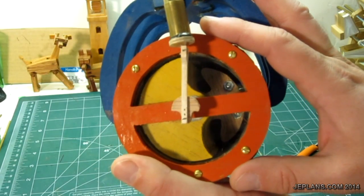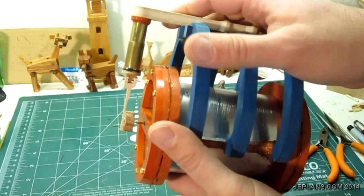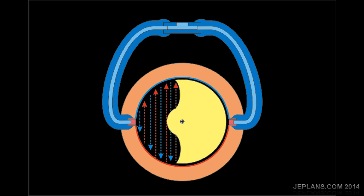I am not giving up yet, so let's look at what could be the problems and apply some things I do in my more conventional displacers. First, when the displacer is at 90 degrees, half of the hot side is exposed to the cold side at the same time, as well as most of the air being exposed to both — this would greatly reduce the temperature swing of the air. Second, too much air space. In my plunger type displacers, I would typically have a max of 12 millimeters or about a half inch of air exposed to a side at a time. We can adapt the displacer like so to fix this.